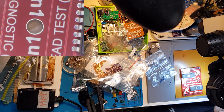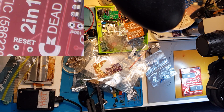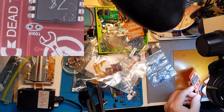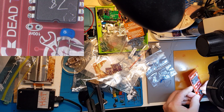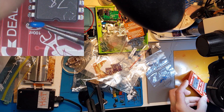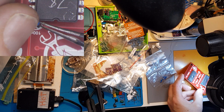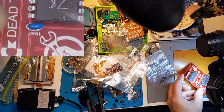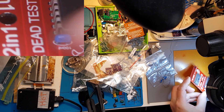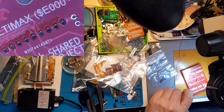We have a standard blue pin HP charger. Let's plug the charger and see what's happening. I have my charger connected to the power supply, and now we need the blue pin HP connector. Let's switch the power supply to 19 volts, some amps — not too much. Plug in the charger and it's doing nothing — taking no current. Pressing the power button — nothing, taking no current.